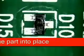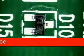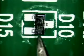Come down, hit the pad and the foot at the same time so you get solder flow, and then come off. Put a little solder back on your tip to keep it from oxidizing. Push on the part and it doesn't move.